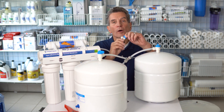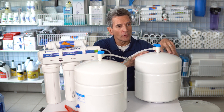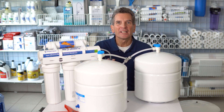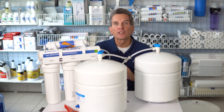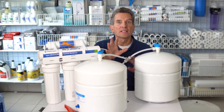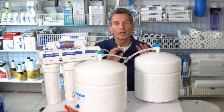Then you turn the water back on to the system by opening up the supply line, open up the flow from the existing tank, and check for leaks. If you don't have any leaks, open up the second tank and wait until everything fills up. Once it's full, you'd be amazed at the difference in flow, especially for the first half tank — that's when you get the most flow, when the tanks are 100% full. Now you've got twice as much time at that higher flow level.